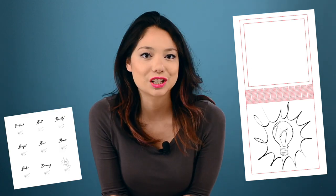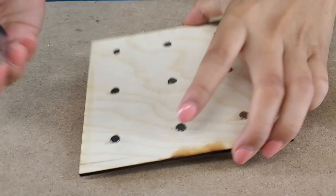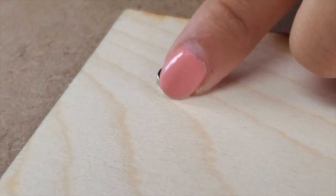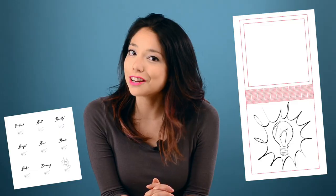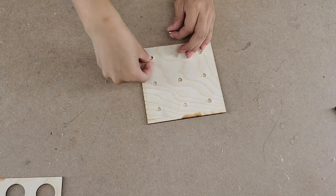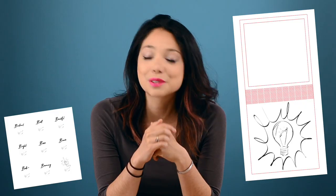The next layer has secret inserts drilled out for magnets on the back, which hold the eyeshadow pots in place. After our initial drilling, the magnets didn't fit snugly because the holes weren't completely flat. So our nifty solution was to use a flat nose end mill attachment after some initial drilling to create a better surface for the magnet to fit into. And this worked perfectly.